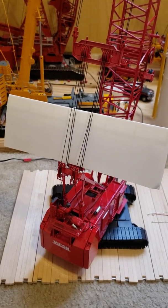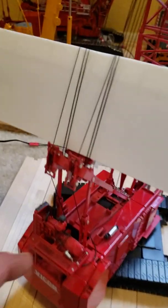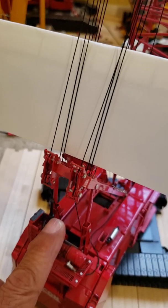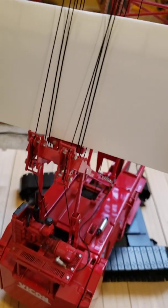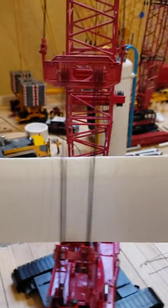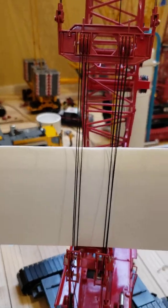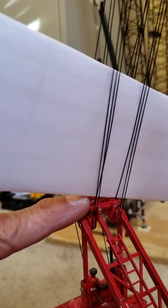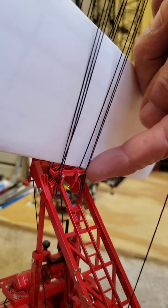So everyone can re-reeve them, because taking it apart would really be a bummer. It does take two drums — you can see both of them right here, both lines coming up. It uses two drums, one wire. There is no tie-off. There's a crossover, or equalizer as they tend to call it on these Manitowocs. Here's a quick view of what it looks like. I put the paper in there so you could see where the wires go. Down here is the crossover — you can see the one wire goes in here, comes across, and comes back up here.